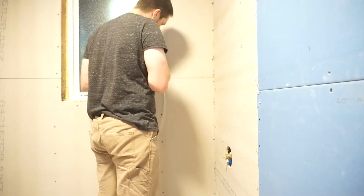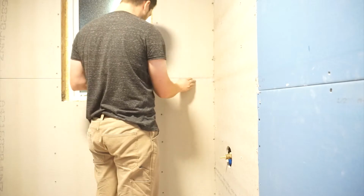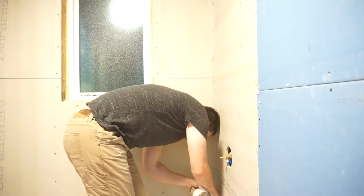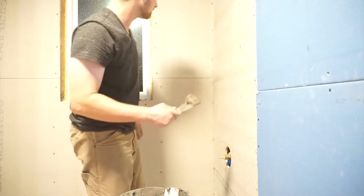If you remember earlier in the video, this back wall of the shower actually used to be the water-resistant drywall. I took that down in order to use Durock instead. Since I'm not going to be putting in a modular shower system and instead going to be tiling it, I thought this would be a better waterproofing feature. The last thing we want is water damage behind our tile that eventually leads to mold.